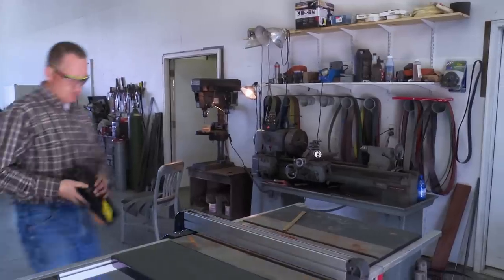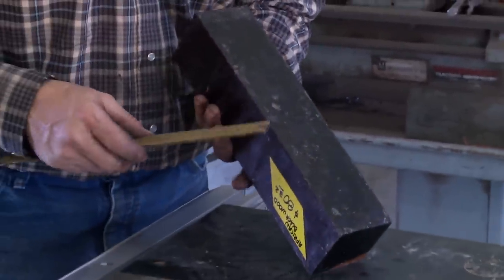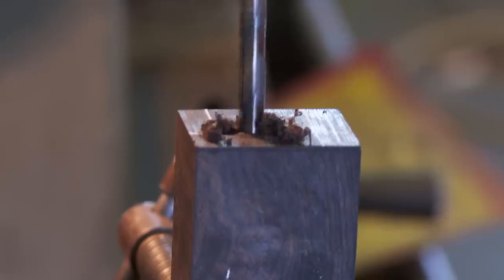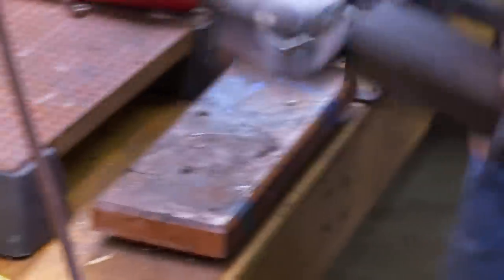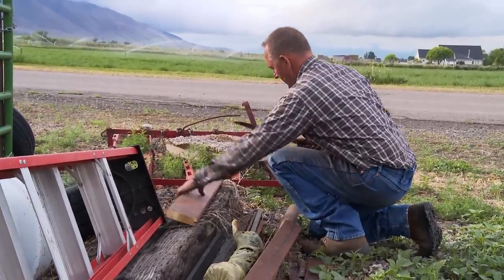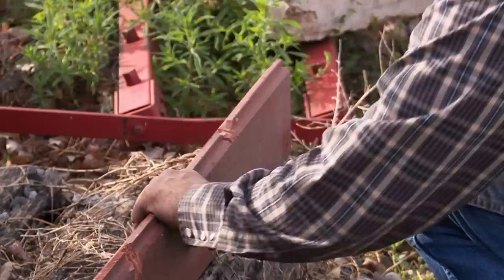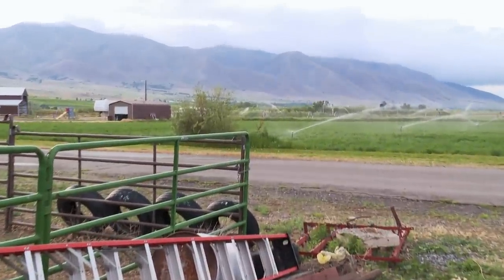After the D-guards, we'll have to cut some wood for the handles. African blackwood is a very hard, dense wood. It's hard to cut, hard to drill a hole in, but it will take a nice finish. I've got them dry assembled. I want to test these blades — I want to know they'll perform. The blade's hard, but it was chipping a little bit because I had a pretty fine edge on it. I'm going to have to change the edge geometry. Still a lot of work left to do.